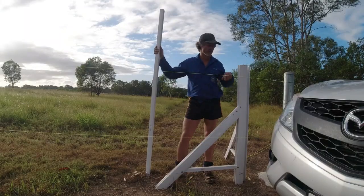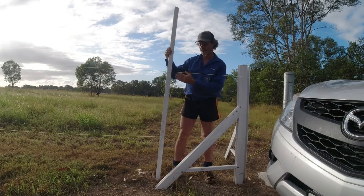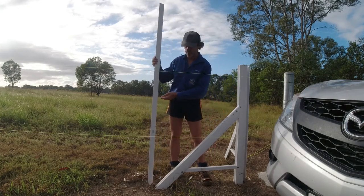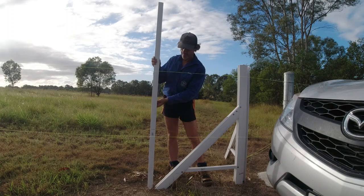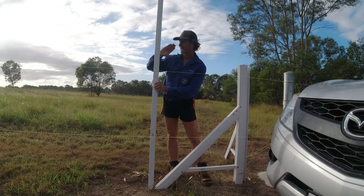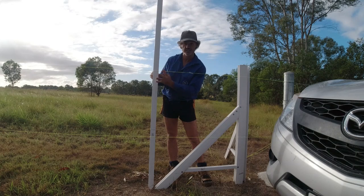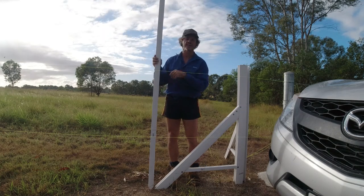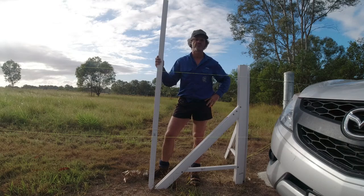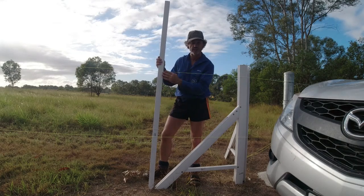The next thing I'm going to do, because the string line is touching the front of the posts where my T-posts are going to go, the last thing you want to be doing is resting the posts up against those lines to keep it square going all the way through to the end, because you're going to be touching it, but ever so slightly you're going to be pushing that line out. By the time you get to the very end, you could be up to 3 inches, 4 inches out, because you've pushed it a little bit every time to get your T-post up against it.